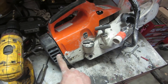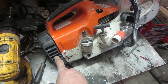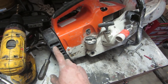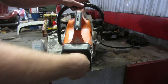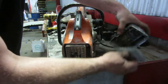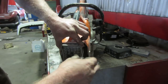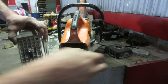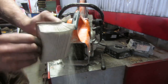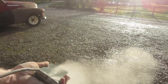I've replaced these filters before, but the guys I buy my filters from always asked me why — because they never replace them, they just clean them out. So we'll show you how to clean these filters. Just pull the back housing off. Inside you'll find a foam filter — that's your pre-filter; if anything, replace that one. Underneath that is the paper filter. Pull that out with four Torx 25 screws, pull it out evenly, and just blow it out until you stop seeing dust. This maintenance should be done pretty well every time you use the saw in concrete or dusty situations.